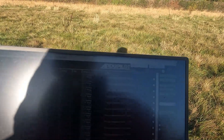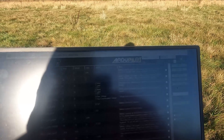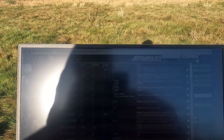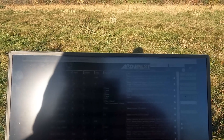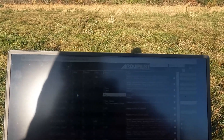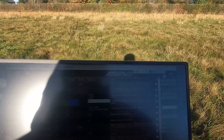Since YARP isn't working very well, I'm checking what the battery failsafe is set to. It's set to failsafe critical action - BAT_FS_CRT_ACT set to 1, which is land, which is what I want. The low action is set to 2 which is RTL, but I'm going to set that to 1 so it lands in all circumstances if the battery goes low.